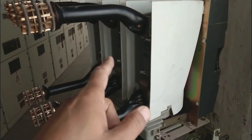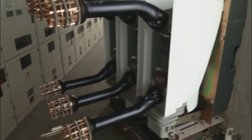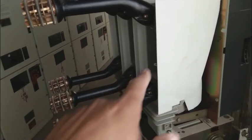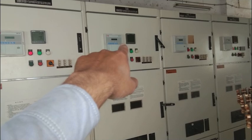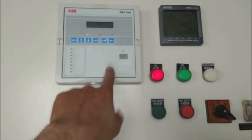The control is provided by this equipment. The difference between an ordinary switch and this type of circuit breaker is that ordinary switches make contact in air, but in this arrangement the contacts are inside a vacuum chamber. Up here you can see the relay which provides the protection — the protection relay is here.